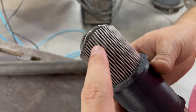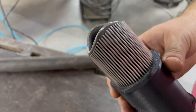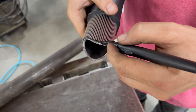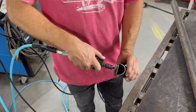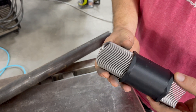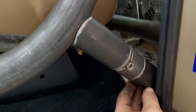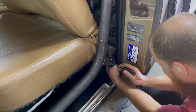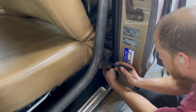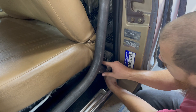You can see the difference between what we need and what the notcher produced — there's a little too much material on the corners that we need to take off. There we go, now we're all set. Kevin is going to sharpie mark it and remove it. The first step is tack welding the joint in position; once that's figured out, we can install the tube and tack weld it into its final position.